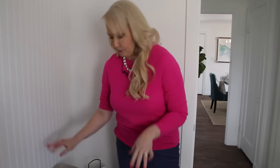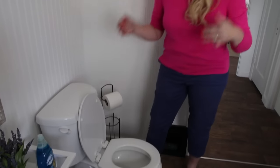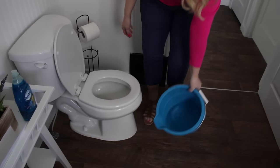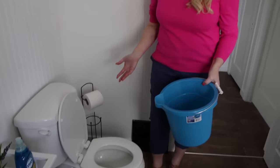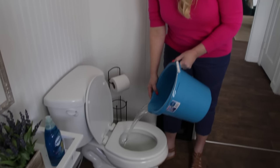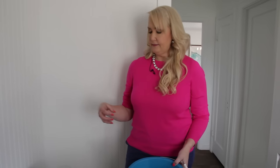That's what you want to do at this point, because otherwise you're gonna have a big mess. So closing the flapper is step number one. Next, you find yourself with a situation that doesn't want to go where it's supposed to, so what you want to try is just get some hot water — I have it in a bucket, but you can use a trash can if you're in a bind. Not boiling, just hot water from the sink or the shower head. Pour two to three cups down into the toilet. That's going to help melt the clog and get things moving.